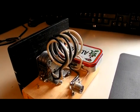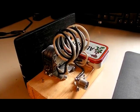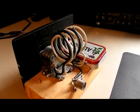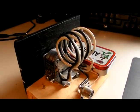This video is an update on my previous build a CB radio crystal set that I did back in 2014. Recently, I got a comment from a guy saying that I should use an 18-foot antenna instead of my 70-foot wire that I use for regular shortwave listening and stuff. And I think he was right on that one.